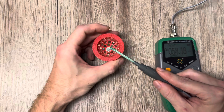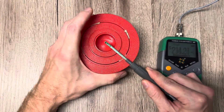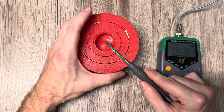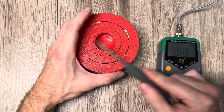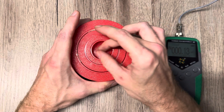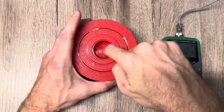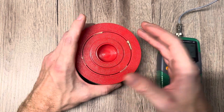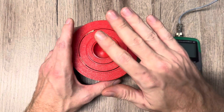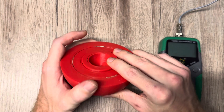Just to compare, with the small array alone we have 58 milli tesla, then back to the combined array — 215 milli tesla. So you can see it's almost four times the field strength. I think this is a really interesting effect — putting these half-spheres of magnet arrays together amplifies the field this much. I haven't seen this strong of an amplification with other arrays before. With ring magnet arrays there is field amplification at certain configurations, but not to this extent with just putting several magnet arrays together.